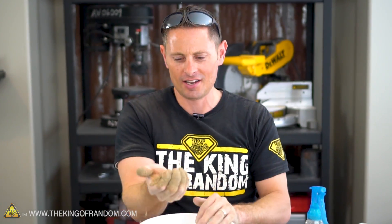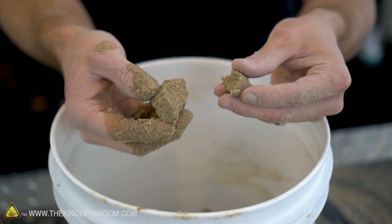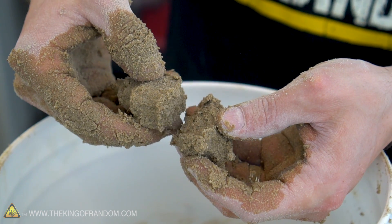Check this out: I've just mixed up our aquarium sand and this time I only used 10% clay. If we do a squeeze check, you can see it balls up in my hand just as nicely as we'd hope, and if we crack it down the center we get a nice clean break. I think this stuff is done with 10% clay, and I think it's attributed to the moisture content — it's a very fine balance though, because you don't want this stuff dripping wet.